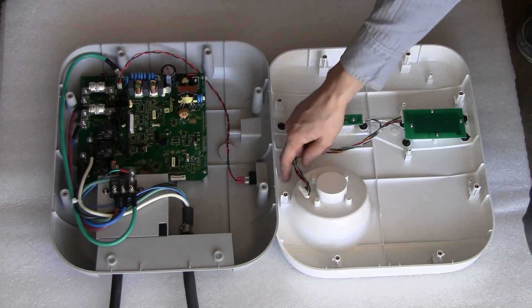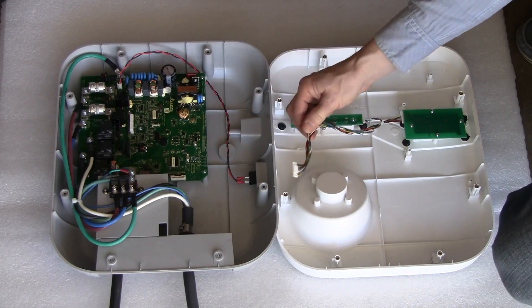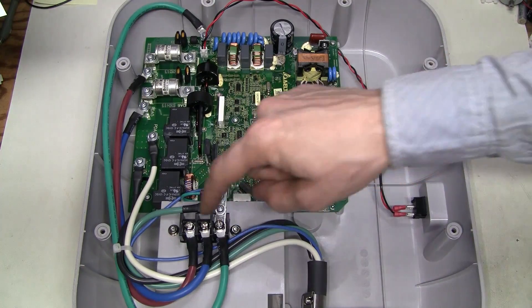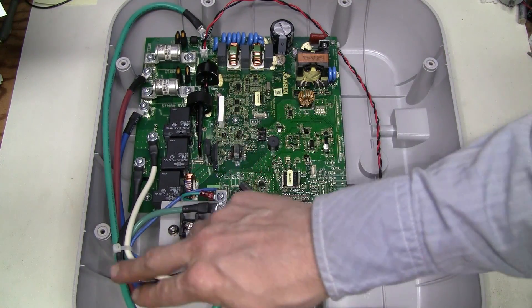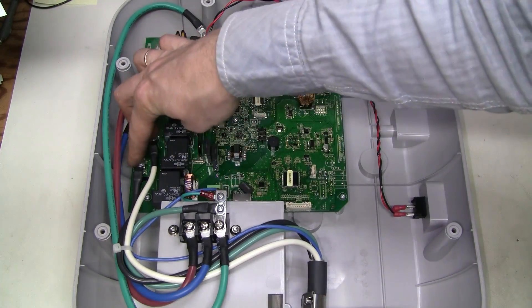Here we are — and that's the reason the green light did not come on. The owner did take this thing apart and just forgot to plug the front panel back in. I explained some details of operation of such chargers in my DIY charger project video about three years ago — I'll put a link in the description. In particular, high voltage lines essentially pass through such chargers with just minimal protection, sensing, and switching. This is our input: these two lines come in, go through the fuses, go through these current sensing transformers, through the relays, and to the output terminals. And this is our charging port.